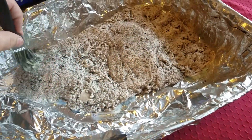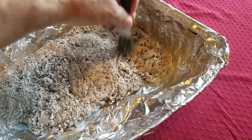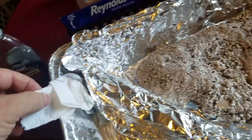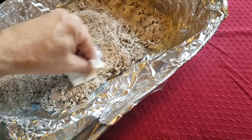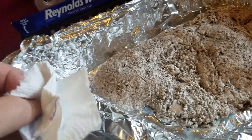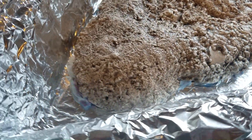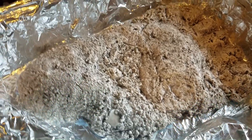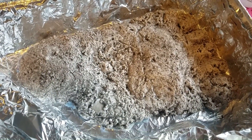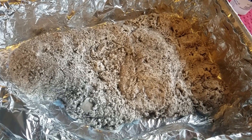Once the soap has been thinned out over the top of the cast, I took pieces of wet paper towel that I used to help remove the excess soap, broke off small pieces, and put them under the edge of the cast where it had large gaps. That's so that the silicone does not flow underneath the cast — it stays on the outer edge. This cast is relatively flat so I didn't have to do it in a lot of places, but it makes it a lot easier to break the old cast out later if it's not completely covered in silicone on both sides.